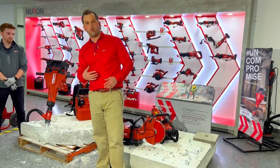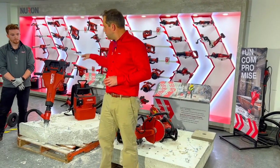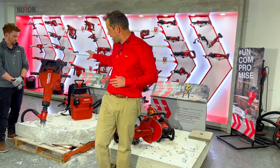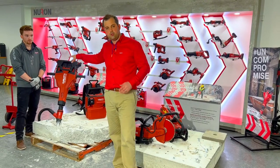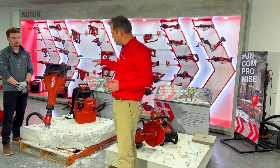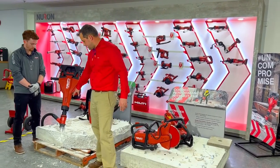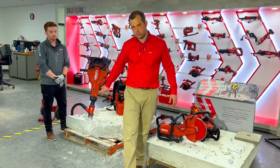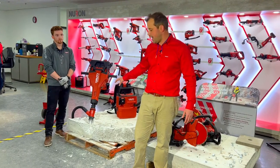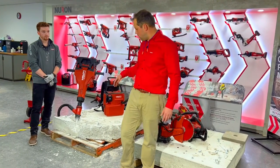This actually hits harder than the corded version of the TE-2000, and part of the reason is because of that dual battery platform. Both batteries are able to give us more power than we actually get out of a 15-amp circuit — that's why this tool hits harder. And with those two batteries in the tool, it is still under 40 pounds, so we're not sacrificing weight for battery runtime. We also have our DRS-B, a system that works with the cordless TE-2000, the corded TE-2000, the TE-1000, and older generation breakers. This allows you to bring a dust removal system into your breaking application and make you OSHA Table 1 compliant.